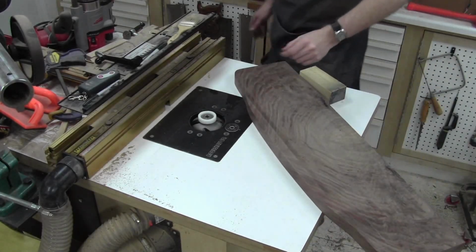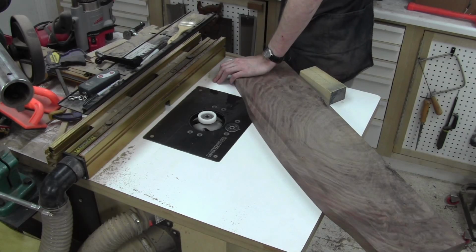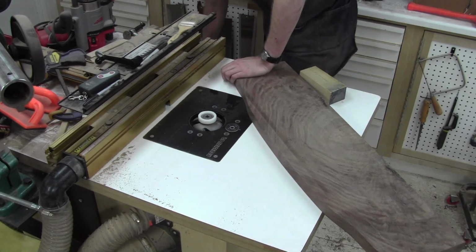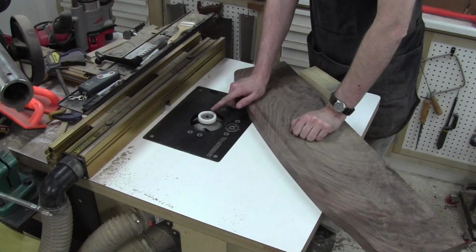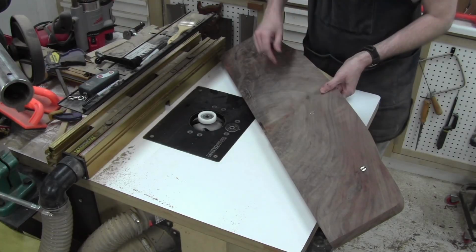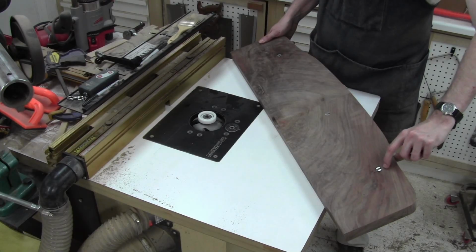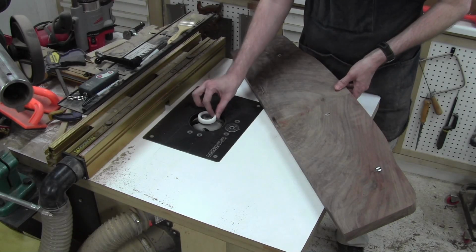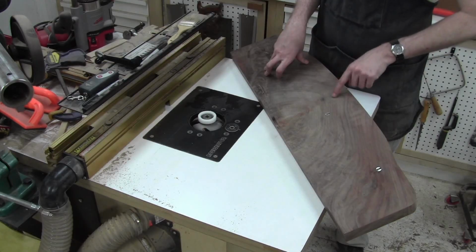Alright, so I was digging through my collection of router bits, and I have a manner of chamfer bits and cove, roundover bits, but I have very few cove bits. I have one that's like a 1/2 inch diameter. It's just too little for what I want here. So I went to my panel raisers, and I've got a cove panel raising bit in here. But the bearing that goes on it puts it way too deep into the edge, so it would have cut into these things here. So I put a bigger bearing on from my rabbeting bit collection, but even that gets me about 1/4 inch to this. It's still too close for my liking. So I turned a Delrin bushing that's about another 5/16 larger in radius, so it now comes way out here, so we should be really good as far as not hitting my joinery.